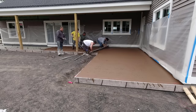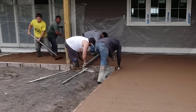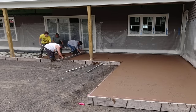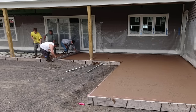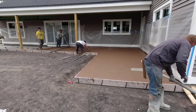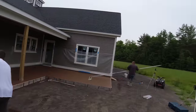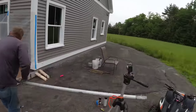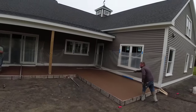As we're pulling the screed backwards, we hold it on the back edge slightly — we don't want to cut the concrete with the front edge because that tears it apart. Holding it on the back edge while applying downward pressure is a really accurate way to screed. Once you run the bull float over it, everything is nice, flat, and level. We can run the bull float both ways because we get it so flat we don't have to go 90 degrees to the screed direction.